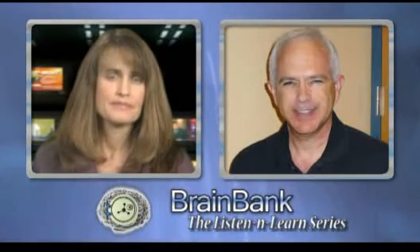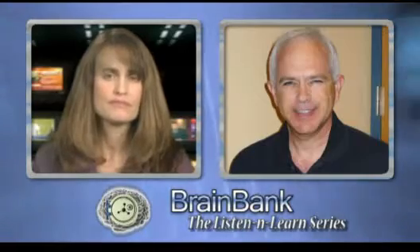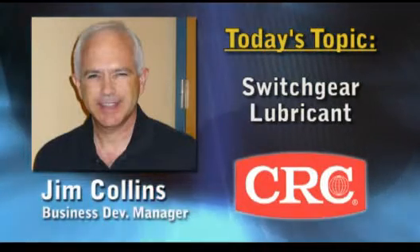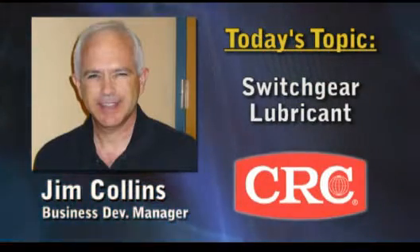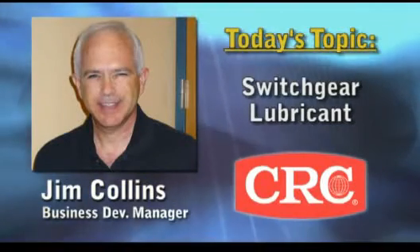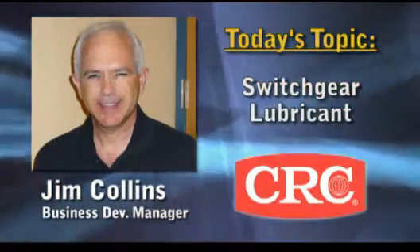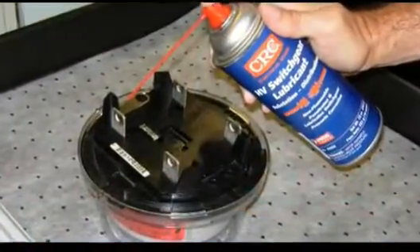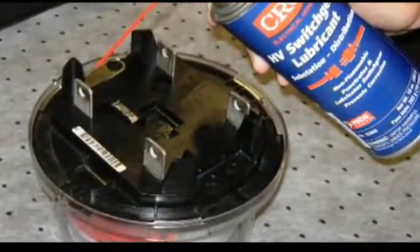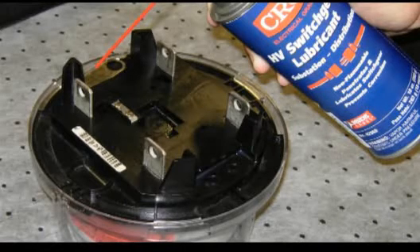How often should high-voltage switches be treated, and what is the typical method? We recommend that high-voltage switches be treated within an existing maintenance program at utilities. That program should initially target each switch and contact, check for previous buildup of old grease, and clean those switches to expose the blades and contact edges. Then we recommend generously applying switchgear lubricant to allow the product to penetrate, lubricate, and inhibit corrosion. Meter bases only need a small amount on the male tabs before insertion. You would reapply switchgear lube each time a switch operates, if desired, to re-lubricate those contact surfaces that have just been actuated.